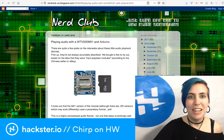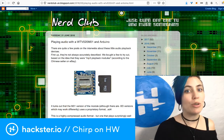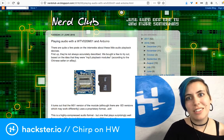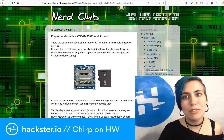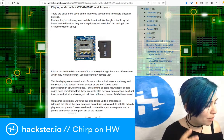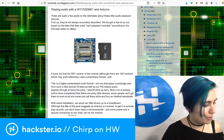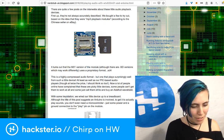Because, let's see. What I was using here is the WTV020M01. Those are all zeros. And Arduino using this tutorial from Nerd Club, which says, just turn off the TV and make something, which, you know, that's a good sentiment. This is from 2016, so maybe things have gotten better since then, but it's the same module, and it seems to have the same problems that they're describing, which is that you have to use a very specific type of SD card, micro SD card, and I did not have the right specific type of SD card.